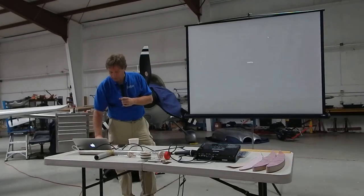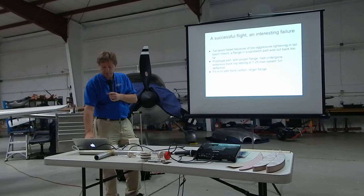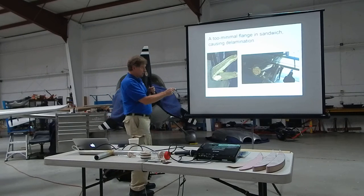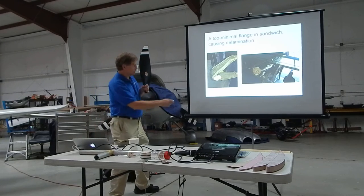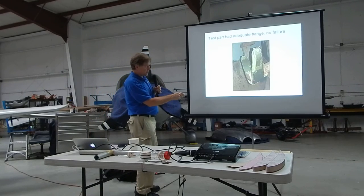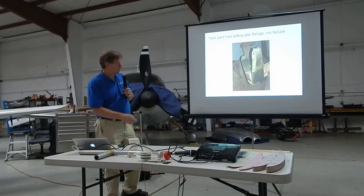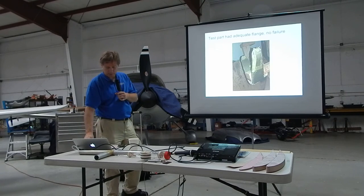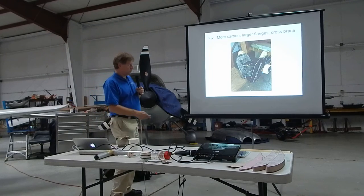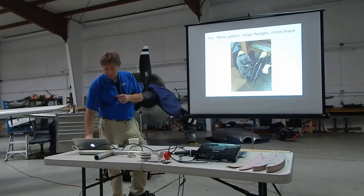What happened to the tail was an interesting failure. We just cut a flange a few millimeters too tight at the high-stress part of the flange — right there, there's almost no flange, and that's where the biggest moment is from the tail. On the one we'd used for testing you can see the delaminated area; there were just a few more millimeters of flange there, so we didn't have a delamination even though we put it under much more stress than what happened during that flight. We fixed it by putting in really large flanges, a bunch of extra layers of carbon fiber, and a strut in the middle. We were all ready to fly the next day but then the weather didn't cooperate.